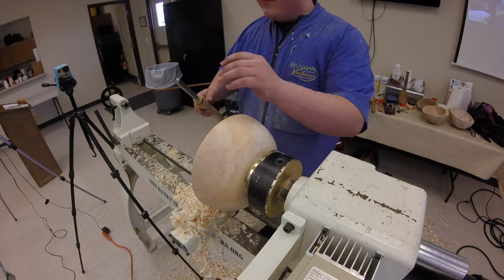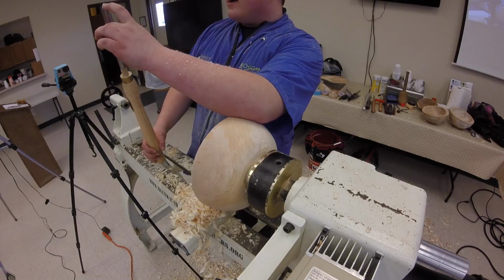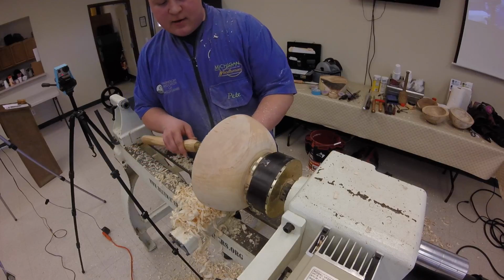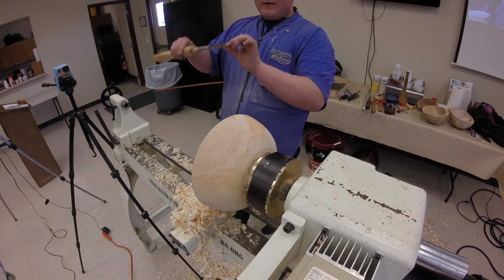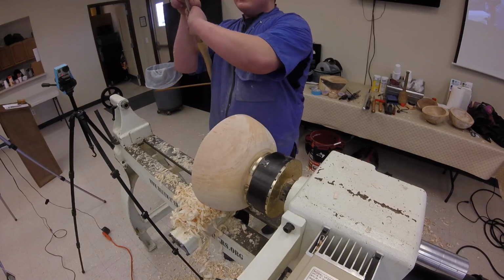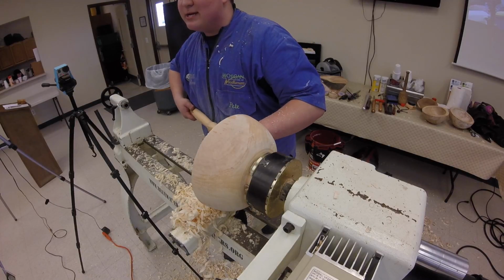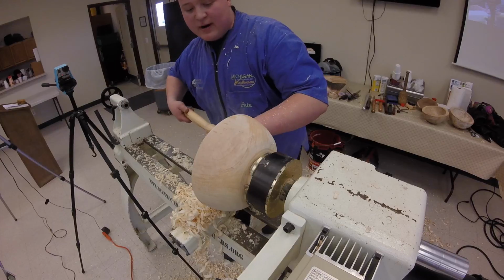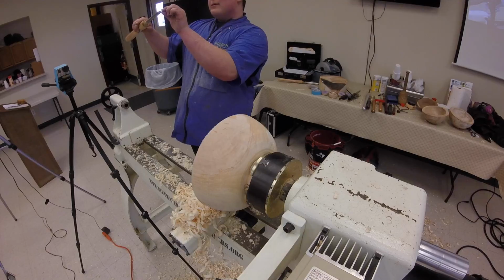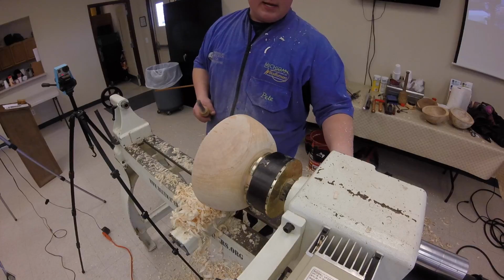Earlier I mentioned I have a relief grind on my bevel. So I have a little double bevel. All I do is just freehand off the heel of my tool. What this does is, when coming around the inside curve of a bowl, if I have a big fat bevel on there, when you get into this corner right here, the only place where that bevel's making contact is on either end, because there is a radius from your grinding wheel. So sometimes it'll be really hard to steer and direct your cut. You might go too far in, you might go too far out, and there'll be a little ridge at that bottom. If I reduce this down to really small, I'll be able to come around that corner really smooth and put a nice big radius on it.